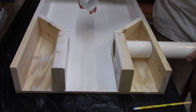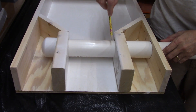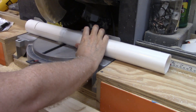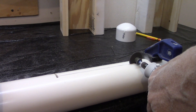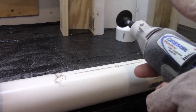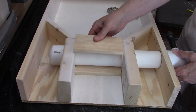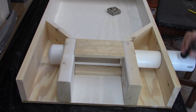With the box completed it's time to put the feeding tube in. I'm using the same PVC as earlier, with the two-by-fours set the same distance apart as the length of that scrap feeding tube. I marked the left and right sides on the PVC, then cut out a feeding trough — basically cutting half of the PVC out to make a half-tube — that transports dog food from the storage bin above to the dog bowl below. A Dremel is used to make the horizontal cuts. It's a PVC tube with a crank on one end, and thin wooden shims are added to block the front and back so food doesn't fall out when not in use.